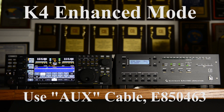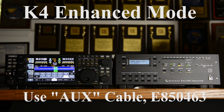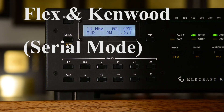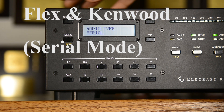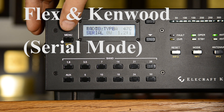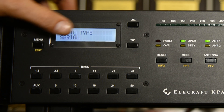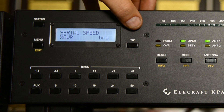As we change bands on the new K4, the amplifier follows and confirms the frequency to kilohertz resolution. For serial radios, two other parameters need to be set. The communications rate for old Kenwoods must be at 4800 baud. For newer radios without that restriction, we recommend setting it at 38.4k. The next parameter is polling—polling must be turned on if you're not using a logging computer.